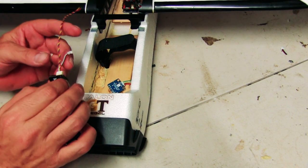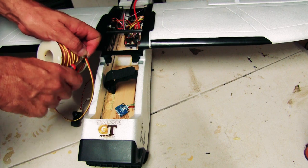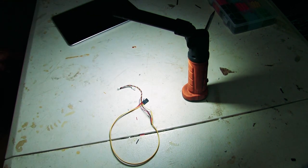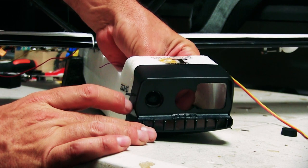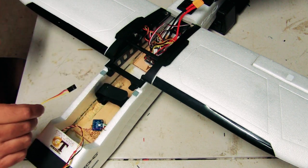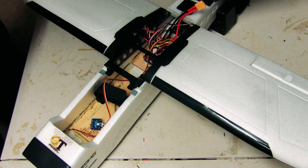We'll make a cable up for the camera. We'll hot glue the camera in — it fits in perfectly — but before hot gluing we'll test everything first. The camera plug goes straight down into three pins: ground, 5V or 9V. I've actually put mine up to 12V I believe, using C1 which is camera one. We'll power this up and see what we have.